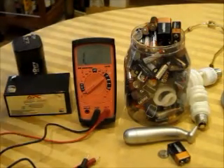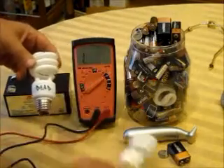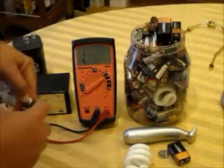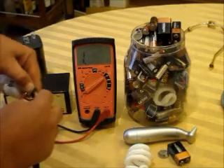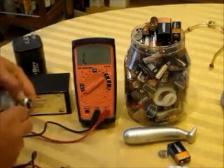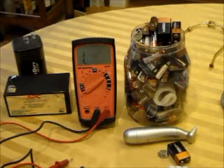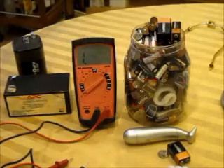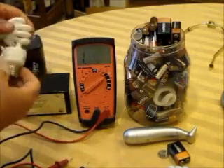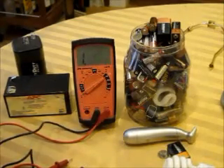It's good. The problem with the fluorescent bulbs is I have a dead one and a live one that I know is good, and if you check them with the ohm meter you get weird things - basically no continuity on either one. But when I put the good one in the light, it works. There's electronics inside the base of the bulb - a ballast and so forth - and for that reason I have not yet found a way to test these with the ohm meter.